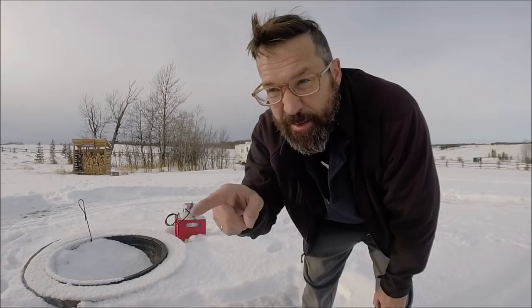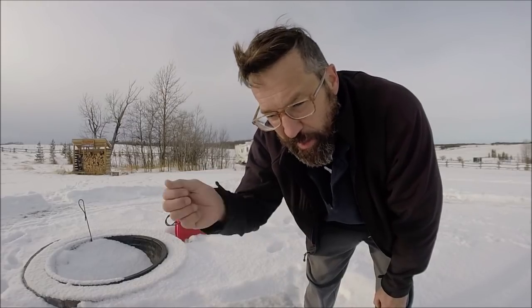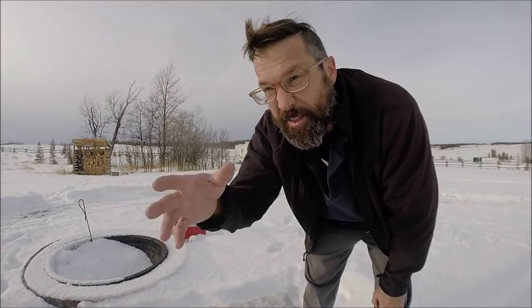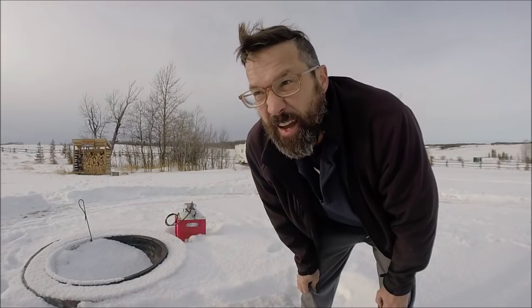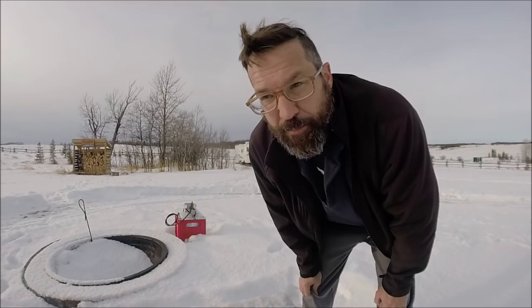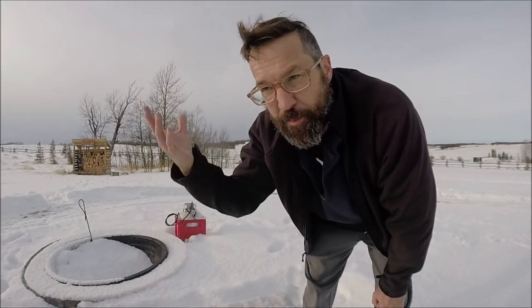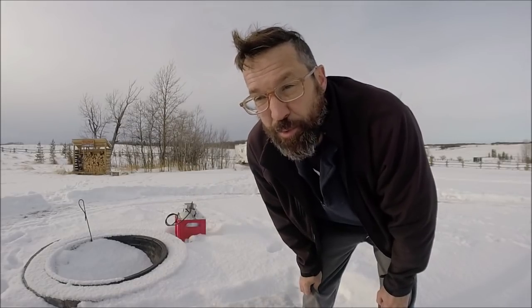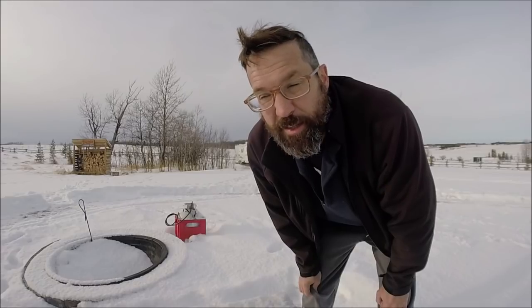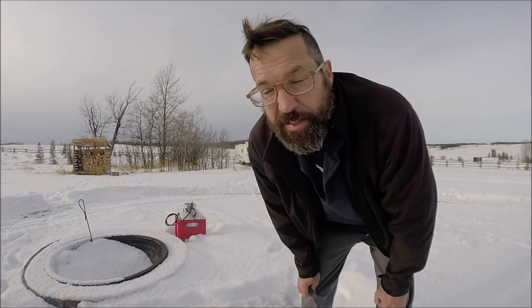There's a fear among the community that zinc is bad, and I've seen some videos where guys go out of their way with muriatic acid or vinegar or things like that to try and remove the zinc coating, but as a chemical engineer, I'm pretty confident that the zinc in this case is not going to vaporize. It's just going to stay baked on there, and it's not going to fill the atmosphere with any kind of toxic vapor. So I'm not fundamentally concerned about that. I'm not going to go out of my way to try and remove the zinc off of this thing.